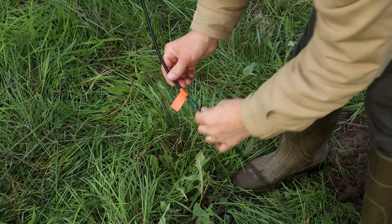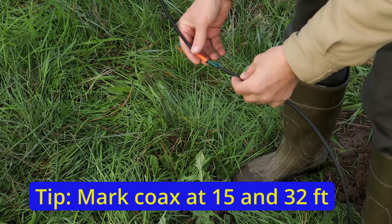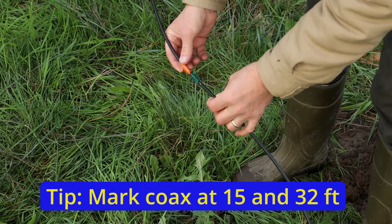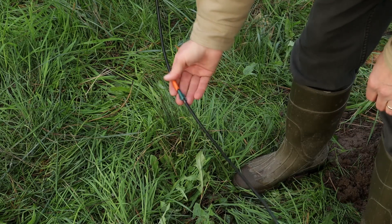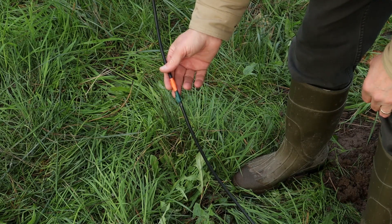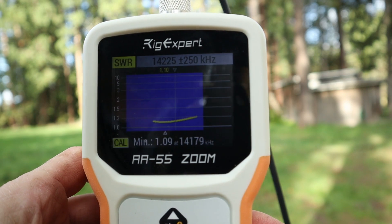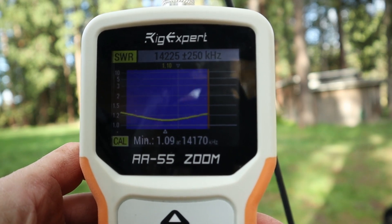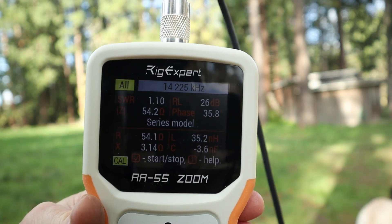Something you can do is mark your coax — mark it with some bright tape. I've got this marked at about 32 feet, which is about a half-wave on 20 meters. That way visually I can quickly see what the height of my feed point is. I've got another marker set at about 15 feet. You have to be aware your SWR is going to be different at that height. Here's where we're at on the 20 meter band — got to be happy about that.